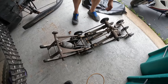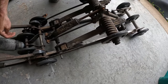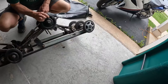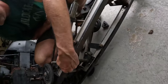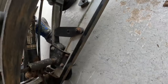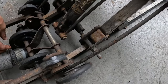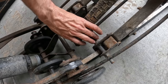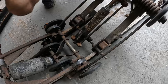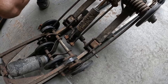So here's the issue. This is why we pull it. First of all, some of them spin. They seem okay. Some of them. One there, maybe. The Hyfax need to go. Look how worn those Hyfax are at the back. It's never good. The reason you got such an uneven wear pattern on the Hyfax is there should be some more bogey wheels right here, on either side of this. That carries the weight of half of the track. From here to here is completely unsupported, and there should be something here. So that's why it wore down so much.